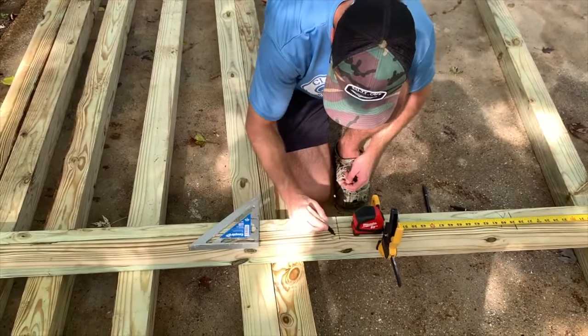Since the side walls of the shed are sloped to match the roof pitch, instead of using top trim and cutting the panels at an angle, I just did staggered cuts and I used something called reno board to give the area at the top a professional finished look. And as you can see here, I used top trim at the back wall of the shed. And here's a look at the inside of the shed with all of the ProCore panels installed on each side.